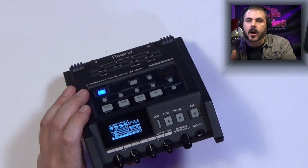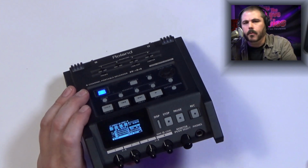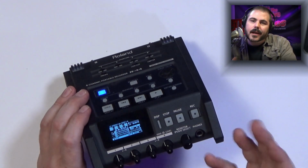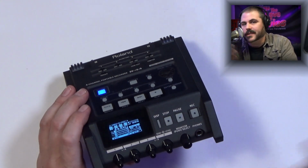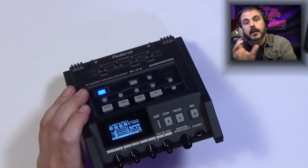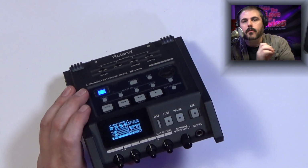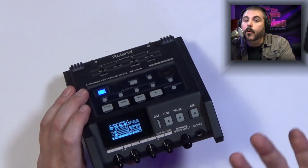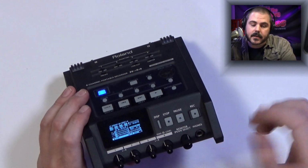The problem is you're going to bring that up in post-production, and there's a certain amount of noise that just exists in recordings. No matter what you do, every machine has an amount of noise, and that noise floor or noise threshold is usually quite a bit lower. So if you're recording up at least -20 and you bring that up to say -6 or -3 in post-production, then you're going to still have a lot of difference between your signal to noise ratio. The stuff you want, the signal, is going to be much louder than the stuff you don't want, that noise. So you can still maintain a little separation between that voice and the hiss and that background noise that the machine just inherently has in it.